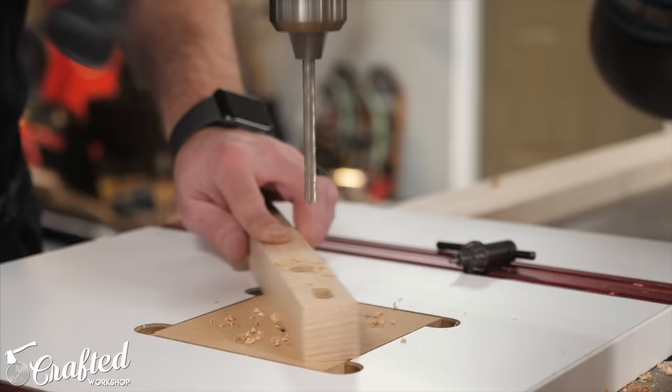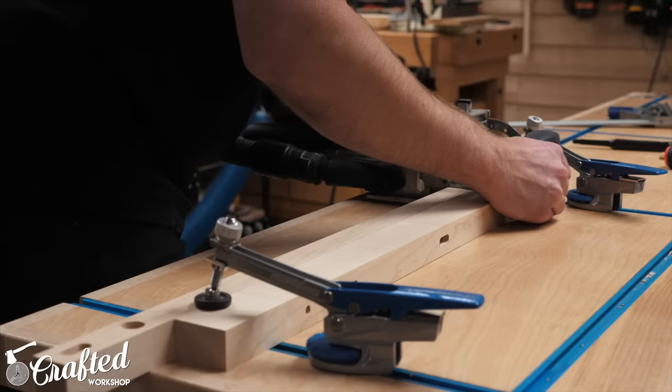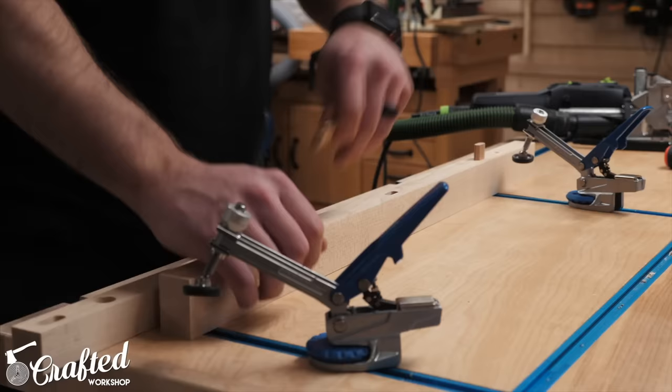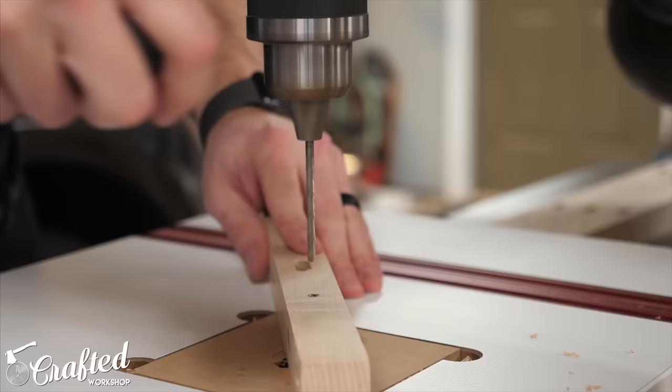Next I needed to create locating pins so that the sides would come together precisely when reassembled. I used dominoes for this, but dowels would be another great option. These locating pins also take some of the load off the bolts and make the joint a lot stronger. After adding the dominoes, I temporarily assembled the pieces and marked the location of the through holes onto the mating piece — this is where the tapped holes needed to be created. Using those locations I pre-drilled the holes for the tapped holes at the drill press.